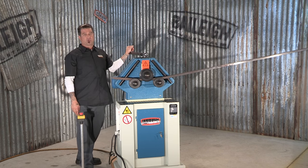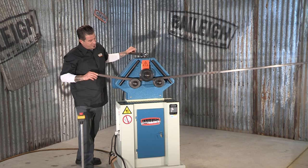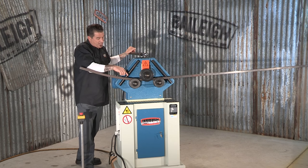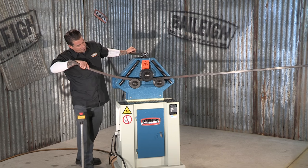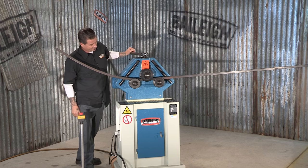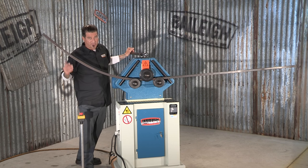You can always bend it more — it's hard to take the bend out of it. You can see this top adjustable drive roll pushing into the serrated lower rolls, single pinch, edge — real nice and consistent. Do this a couple times, you've got a perfect hoop.